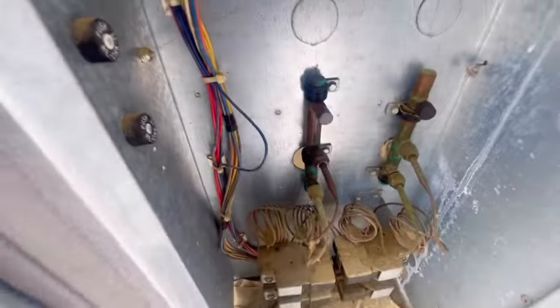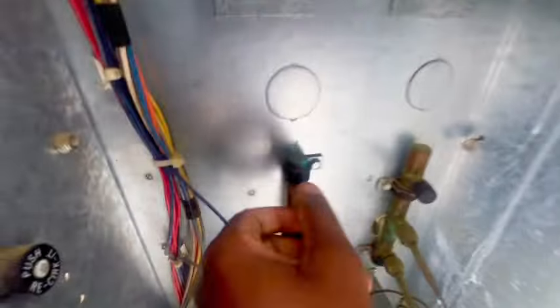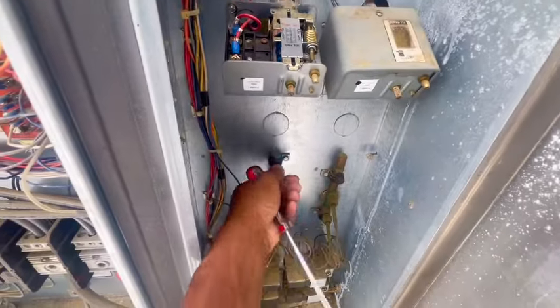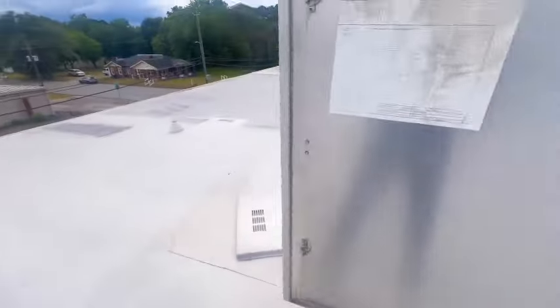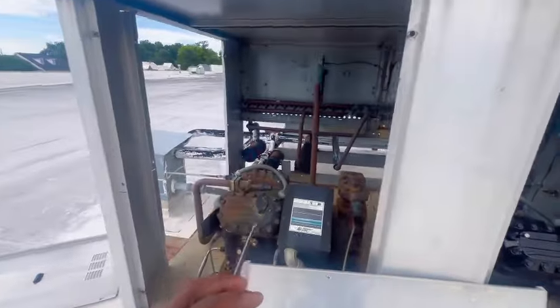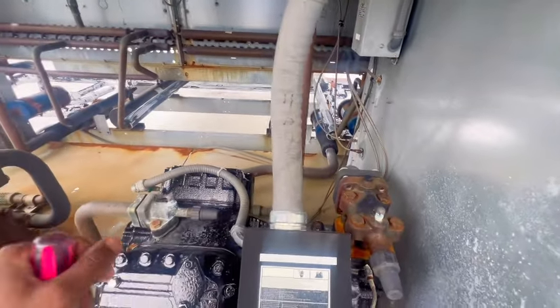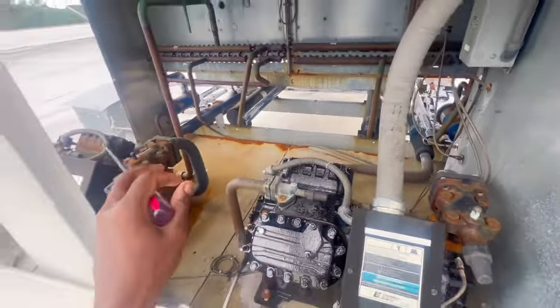Based on observation before grabbing my gauges, I can see this area is oiled up and this cap was pretty loose. I need to check where our pressure cut-in is — it's set around 25 PSI so it probably hasn't even been met. I believe it's this compressor because I traced it — this first stage has to be that one, and this one for the other unit, but this one isn't being called for.